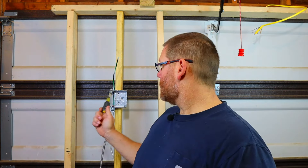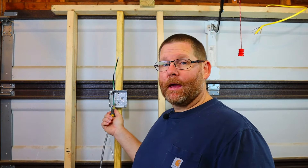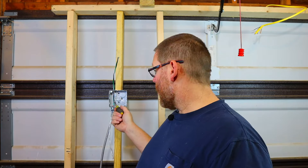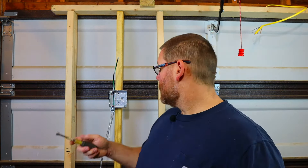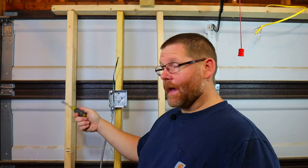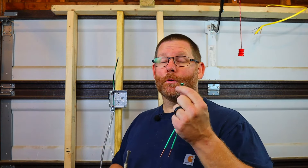A little information you may want to know: if you have any device or junction with wire nuts in a box, you have to have a green ground screw along with a pigtail. Anywhere there's a joint — whether on a device like a receptacle, switch, or GFI, or just a regular junction box — you have to put one in. If a wire gets loose and touches the box, it needs to be able to ground itself out. If the wire is just passing straight through with no junction, you don't need to do that.